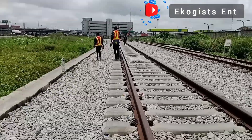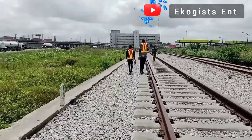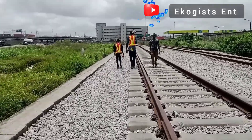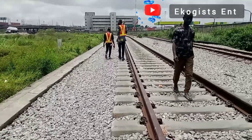Stay with me as I take you around the site to show you how far this has actually gone. Walking along this track, with your natural eyes, you cannot see the sinking. You need an instrument like the leveling instrument or the GPS in order to determine the levels.